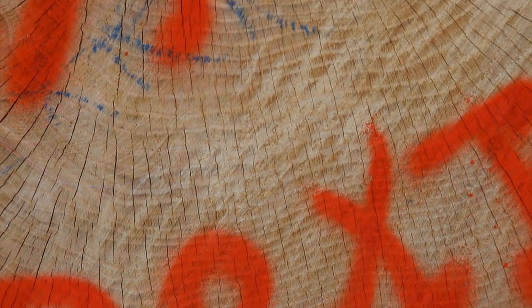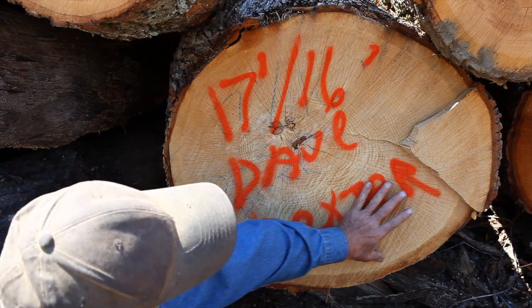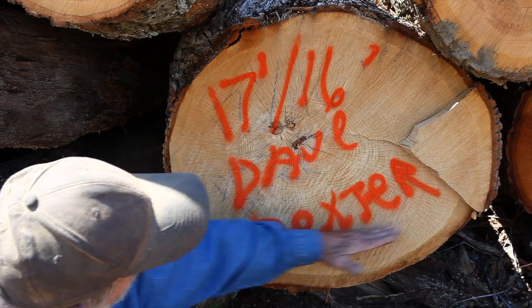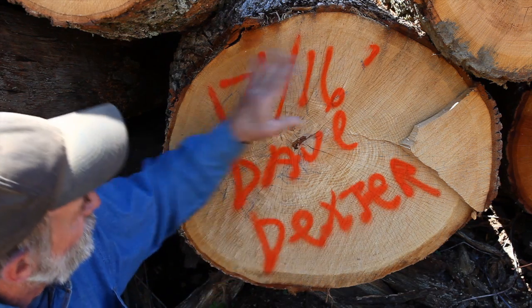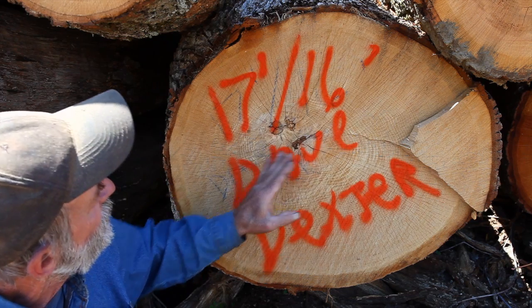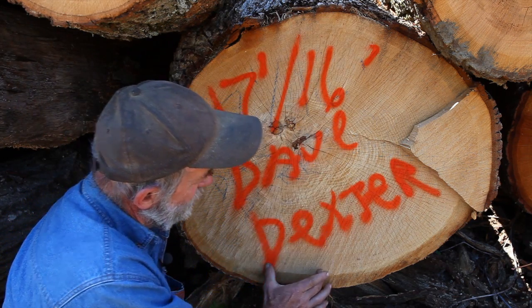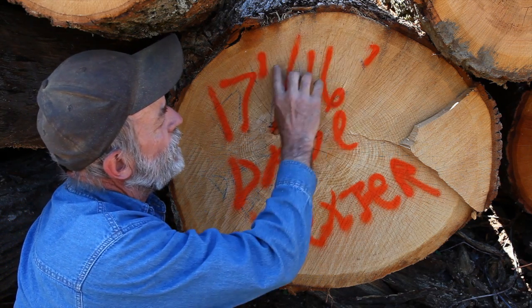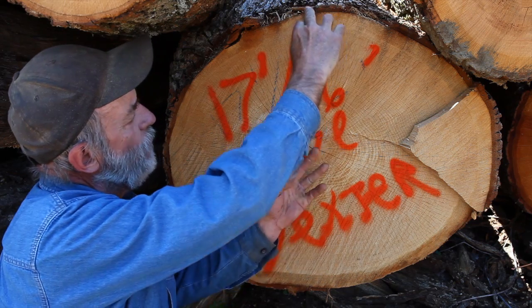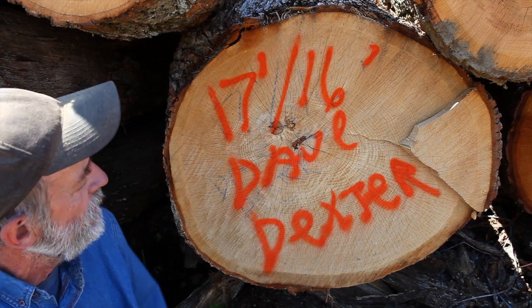I'm looking to get a very large timber out of this thing that's about 14 inches by 8. And that is going to come out alongside the heart right here with the annual rings going through the timber this way. But in some position, this log is going to get rolled, and in some position I am going to take a 4-inch swath right down the middle of it like this to get quarter sawn material with the annual rings going across the board like that. So it'll be like 4 inches by 12 inches.